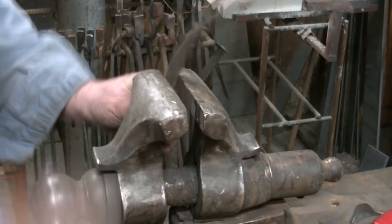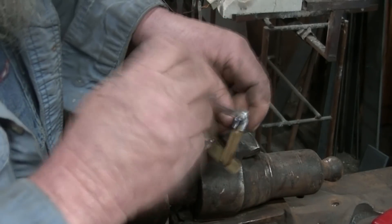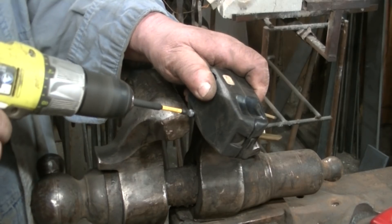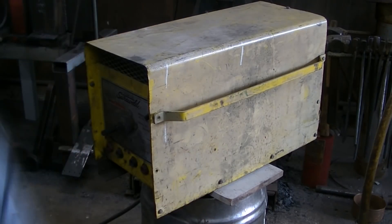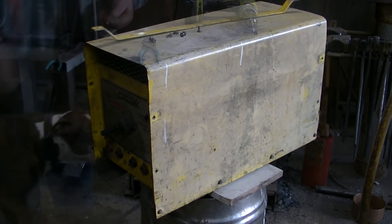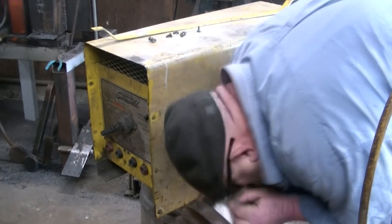It's got a really scary cord wired to it at the moment - oh my goodness. We are going to put a brand new plug in this thing. The cord length looks pretty good. We'll blow it out, check and make sure the circuits and wiring on the inside are connected and not corroded, and fix the switch. That's about it.